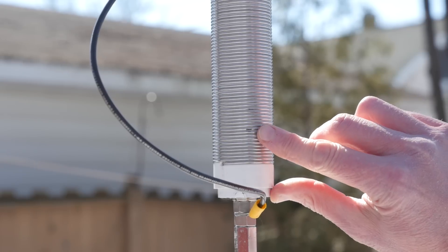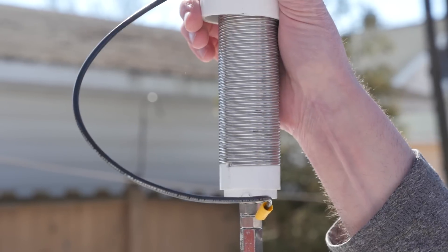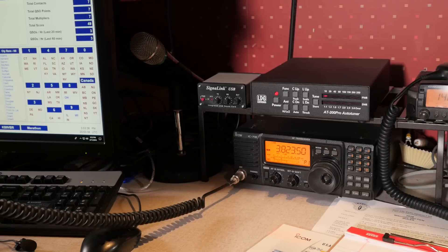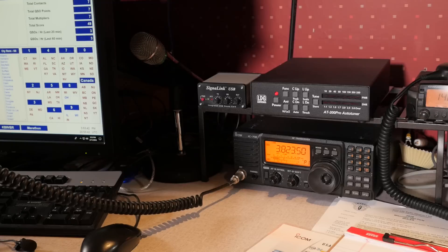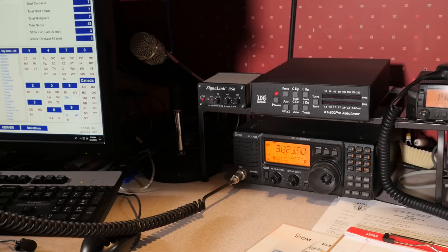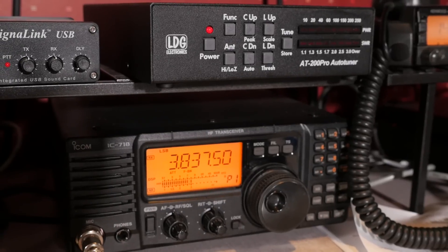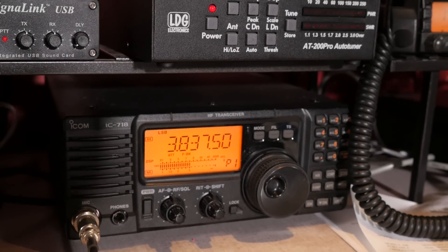Your mileage may vary, but I was able to get the SWR down to about 1.3:1 or less depending on the frequency. I like to mark those tuning spots with a little bit of magic marker so it's easy to change bands — or you can run a piece of tape around the coil and put your tuning spots on that. Then I connected my tuner and commenced to operate. The tuner pretty much found a match right away, so you could really use this antenna without a tuner at all. You'll be able to manually get the SWR down low enough, but I use it for convenience when switching between antennas.